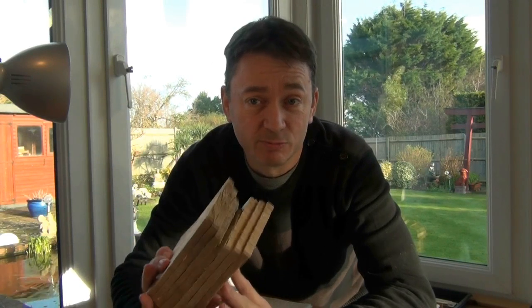This wood is ringing wet — it was only felled in the late summer, so I've only just cut it out of a log. I need to dry it out and I'm going to try something I haven't done before: stack it and clamp it with some absorbent towels in between each layer, change those probably every day, keep monitoring the moisture content, and see how quickly I can get it down to something workable and whether the boards stay flat.